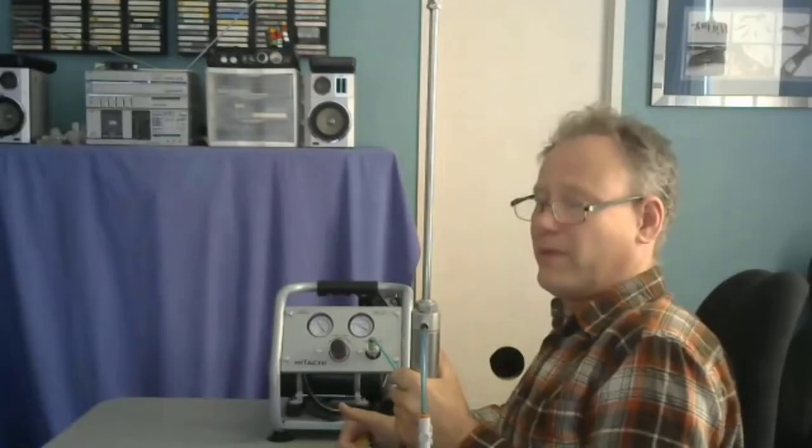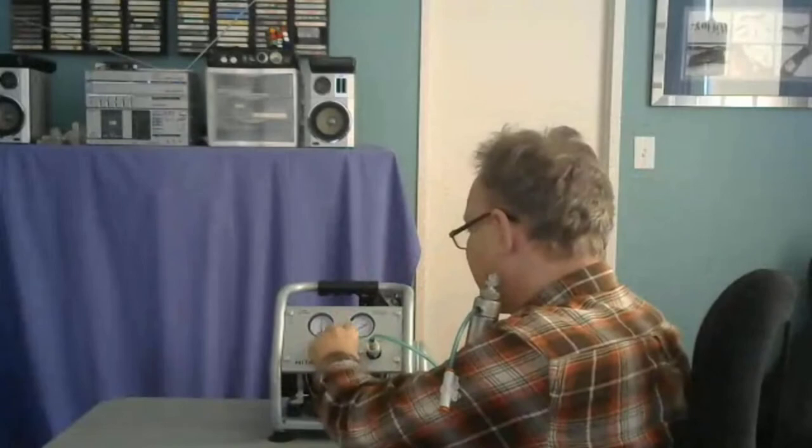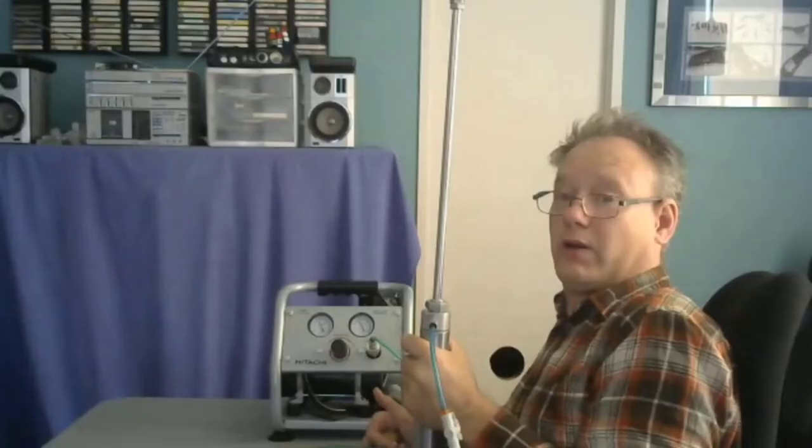So, should we go higher? Let's go higher. We're starting to see why we need a pressure compensated flow control. Okay, I've got it at 100 PSI, here we go. That's moving pretty quick. So we can see that, let me turn this down.